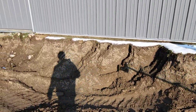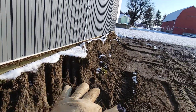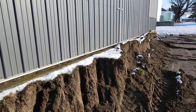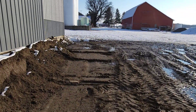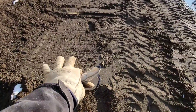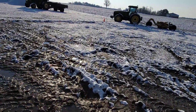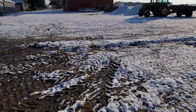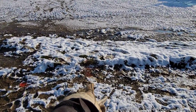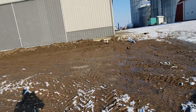So I don't want to tear this apart until — right, you don't want to undercut it. Our floor height there is 5'1". That's down but inside the barn. We want our floor to be two foot lower, and we're still gonna have four or five inches of fill here. There's a spot out here where Dad measured where he's basically not taking anything off — we'll have to have eight inches of fill because we're gonna have six or eight inch concrete. So right here we're gonna need eight inches of fill and then the concrete to get to the floor height to be two foot lower than there.